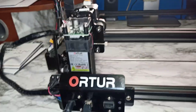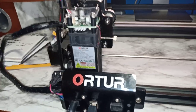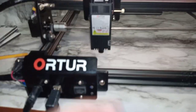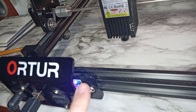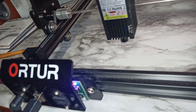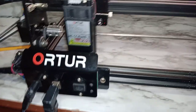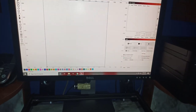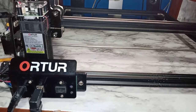Before you start anything, you want to home it. Click home and the machine should start homing automatically. I caused an issue here because the machine was going and I interrupted it — got a blinking purple light. So I have to reset: hold the power button for a couple seconds, then hold the reset. Then start your program — I use LightBurn — and hit home, and your machine should start homing automatically.